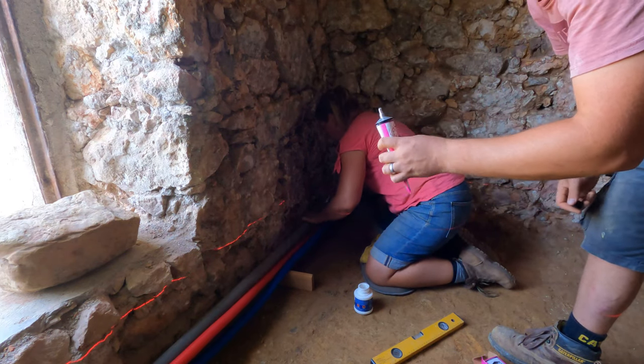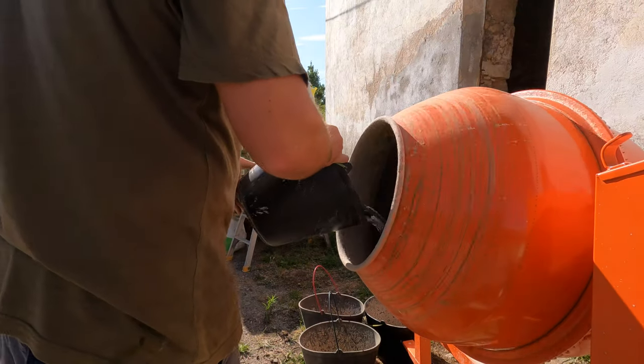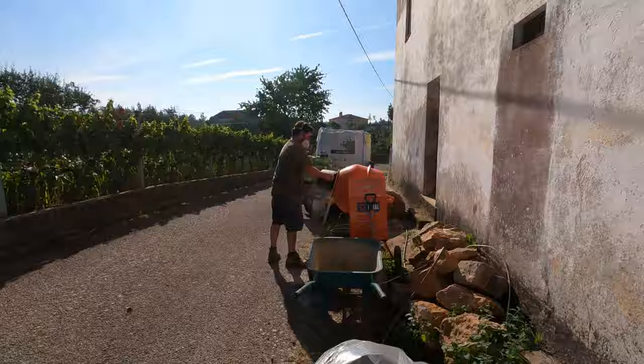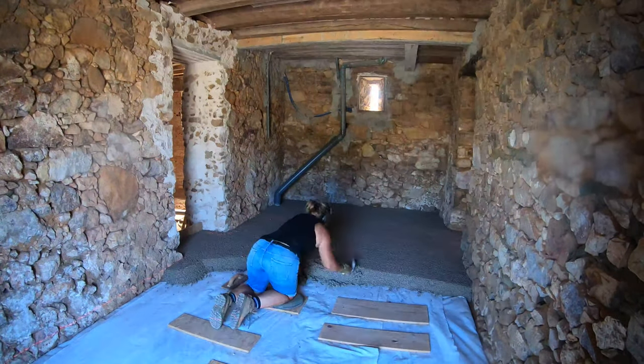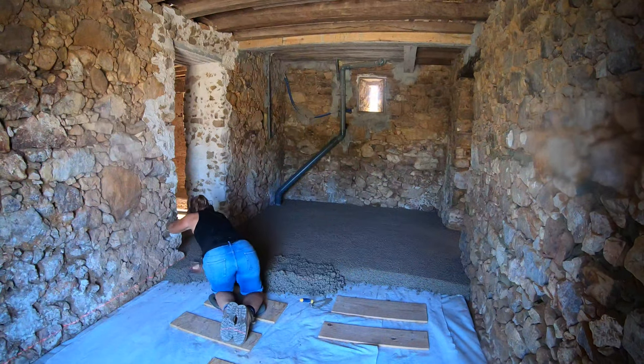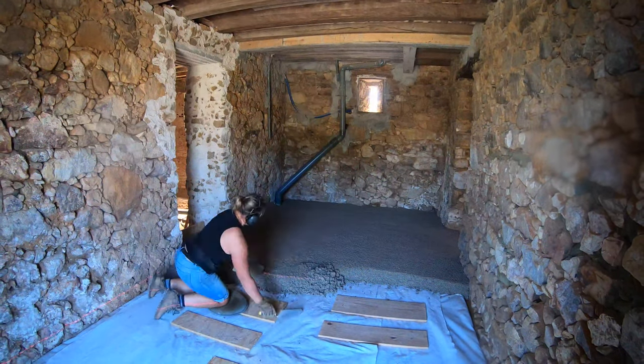I understand that. After knocking some holes through the wall and laying some grey water pipe, we laid the first two layers of our limecrete floor, concealing the pipe beneath a solid lime and lecca slab under a layer of geotextile. But then we realised there was a problem.